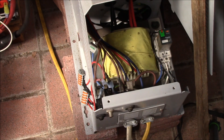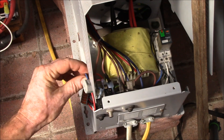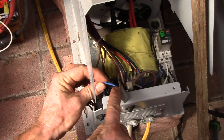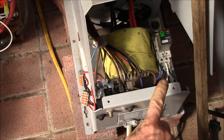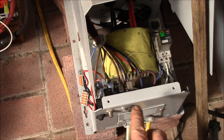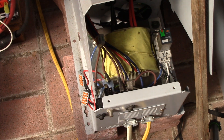One thing with this relay — when I was testing it in the previous video, the coil contacts were hardwired to the input power, but that's going to be different in the final version. I've brought that blue wire over to a connector and I'll be using my Arduino relay to turn power on and off to that blue wire, which controls the coil. The other side is hooked to the neutral, and that relay will only be on when I'm running the inverter from grid power, allowing me to switch between AC power from the grid or DC power from the battery bank.